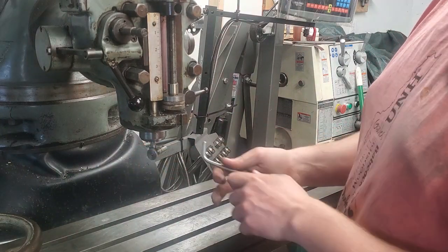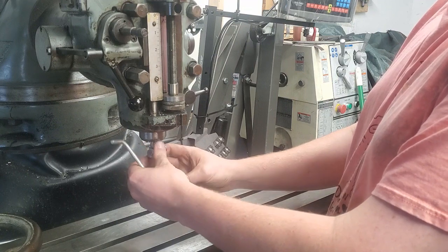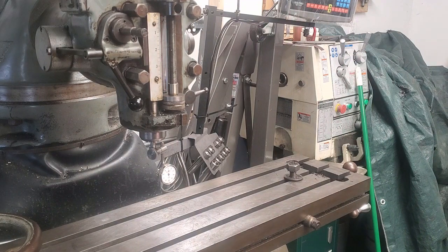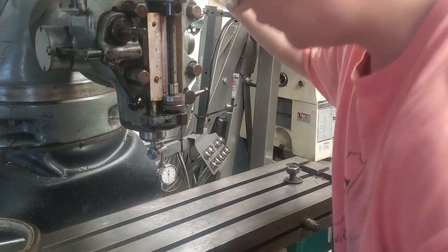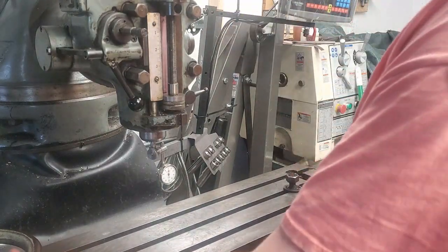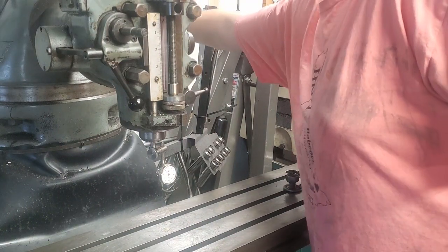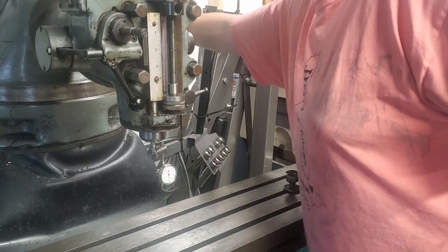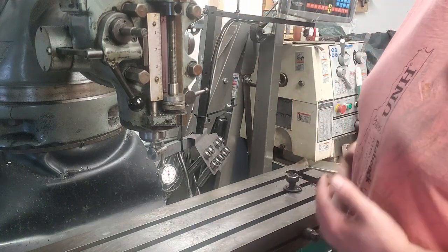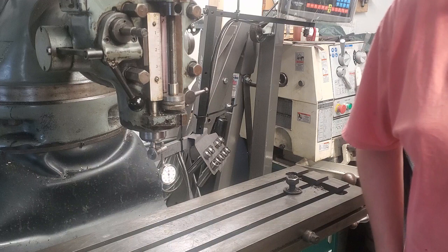I think that you don't need to be perfect — it's a milling machine. It's not a surface grinder. They're not going to be perfect; you're going to have error. Especially once you start considering that there's wear — this machine is not new, it doesn't repeat perfectly, it never has since I've owned it, and it likely never will. So if you're debating whether that's half a thou or more than half a thou, you're plenty close for milling machine work, at least in my opinion. You've got to be realistic about how accurate your machines are, or you start chasing tenths on a mill and you're just going to frustrate yourself.